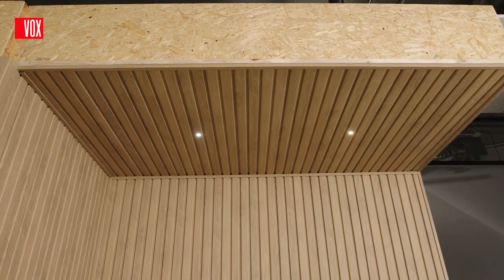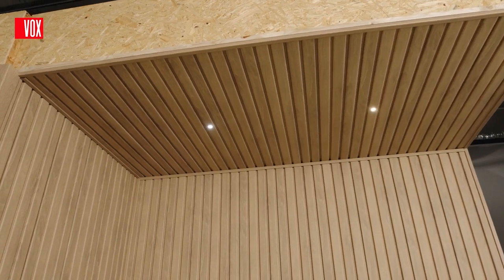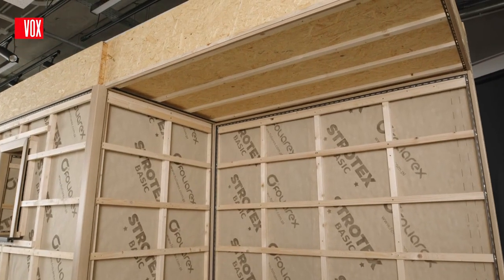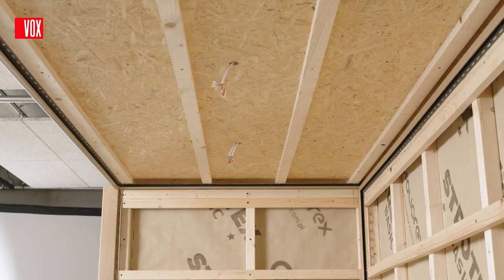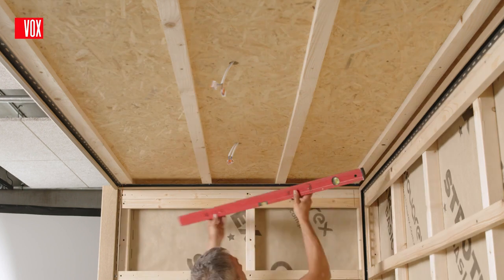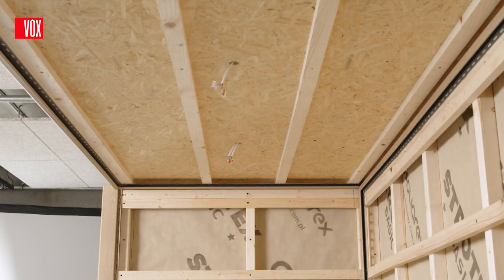Fronto slats can be installed in a recess as a soffit, provided that it is protected from direct sunlight. For this installation, a substructure with a maximum of 40 cm spacing between wooden battens or metal profiles from center to center is required. It is essential that the substructure is suitably level. Make sure that the right and left edge battens and the wall side battens are spaced away from the edge, depending on the type of installation on adjacent walls. This will enable the panels to be properly secured.